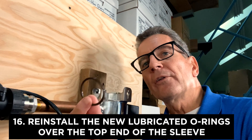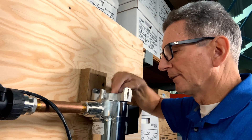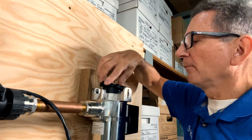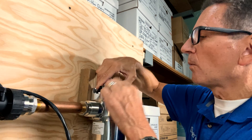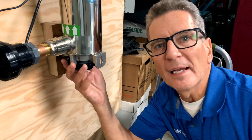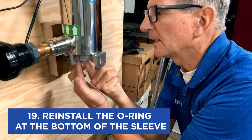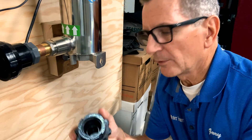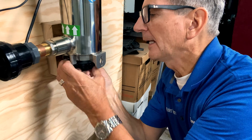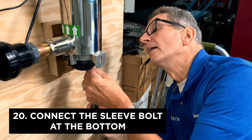Once the sleeve is fully down, grab your o-ring. The manufacturer recommends water to lubricate it, but I find silicone grease works better — position it around the end of the sleeve. Grab the top bolt — the one with the wire form. With the wire form open, it should face away from the inlet and outlet; you'll rotate it 90 degrees to lock it in place, with the hole lining up toward the inlet and outlet. Back at the bottom, slide a greased o-ring over the end of the quartz sleeve, make sure it's fully seated, then face the hole toward you and turn it 90 degrees to lock it in. It'll be quite stiff. Once in place, install the bolt with a Phillips screw.